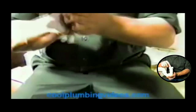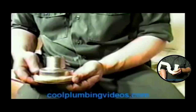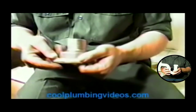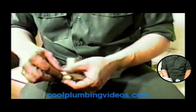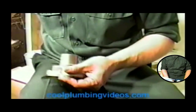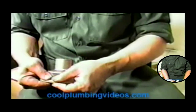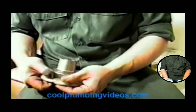What we'll do is take it — I'm smushing it out just like Play-Doh. Then I'll take the basket strainer and take the putty and go around the top of the basket strainer, placing the putty on there. Now we're here at the other end. This excess, we'll just kind of trim that off and put the rest back. Kind of smoosh down a little bit so it'll stay in place when you go to flip it over and squish it down into the hole of the sink.